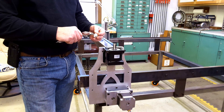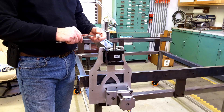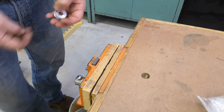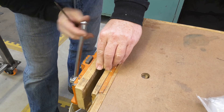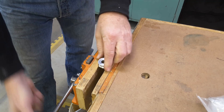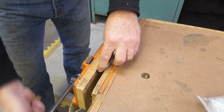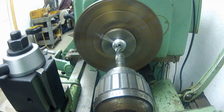One of the complications I've run into with my design is that I've used big stepper motors — NEMA 34s — and their requisite components, in the case of this planetary gear, with a fairly small belt drive specification. So for everything I'm having to bore out the hole in the different cogs and things like that, and no exception here. After taking some measurements I popped off the pressed-on shoulder and then into the lathe I went where I bored it out and made it fit.